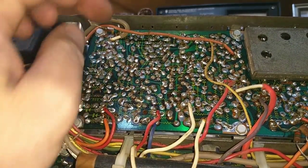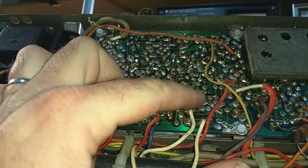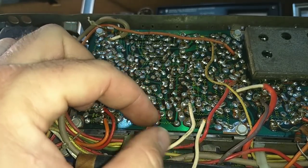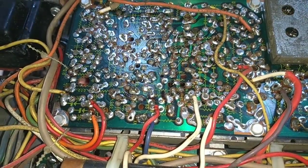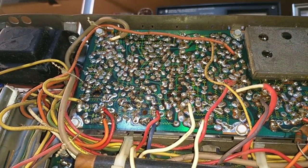I don't think it's going to be relatively easy to figure out which one's which, because they just have symbols here — like a test point, test point C2, and Q2 for a transistor, Q19. But there's no markings for the resistors and no markings for all but a few capacitors, like C16 here. And if I reach around the board and look at C16, that's a film cap, so that's not even what I'm looking for. This is going to be a little bit tricky. It's probably going to take me quite a bit of time to trace down and do all these, and I'm not going to do that on camera because that's just torture. So I am going to pull and replace all these electrolytics, and then I can work on finding that bad resistor and changing that as well.